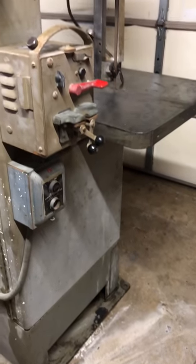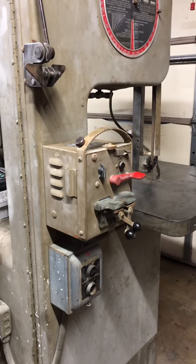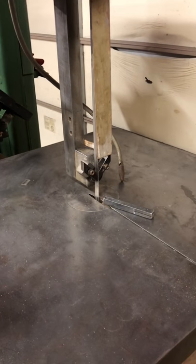So I took two old blades off of a 64 and a half inch bandsaw, cut and welded them for the new saw. Pretty cool. So I measured for the blade by the spec on this saw that I found online, which was like a 125 inch blade, but apparently it's a 122. So I had to make another cut and weld, but that went well. I've got the new blade, or the old blade, made new, mounted on the saw. I'm going to give it a shot now.